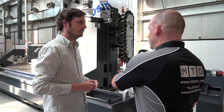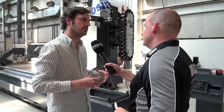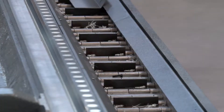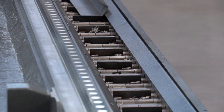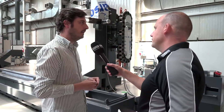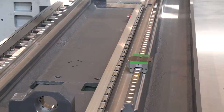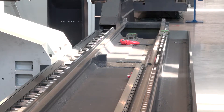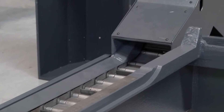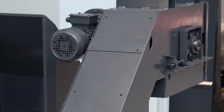Now let's talk about the build of this machine — we've got a two-piece casting with a column attached to the bed. One of the main differences improved from the past in these machines was the space for the longitudinal chip conveyors. In the past there was just a fabricated tray under the machine. Now from the same bed casting we integrate the chip conveyors as well, with a channel at each side of the casting where a conveyor goes in. That means far less risk of leakages — it's much more reliable and simple.